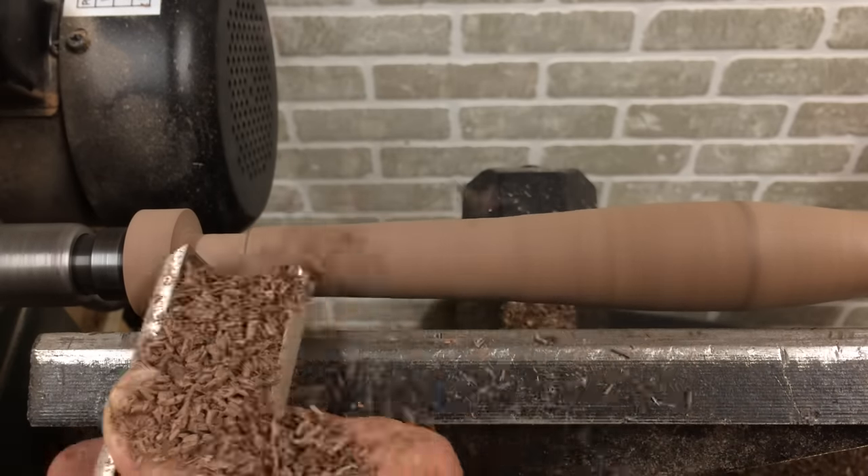This chair is now solid and not rocking, so it's all great. The last step to finish this chair is to put the finish on. This chair is a little bit odd in that it doesn't have a protective finish - it's just got an oil finish. I suspect there's some color that's been added here, so if I just put oil on this walnut, I don't think it's going to match. I've got some samples here that I'm going to use to do a match. I think it's probably a chestnut color. In between putting on the coats, I've got a loose arm here that needs some attention - it's just a screw and a cap. I'll take it apart, glue it back together, and then go on to the other chair.